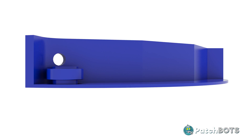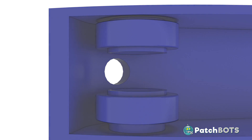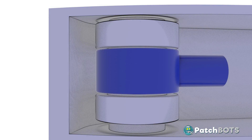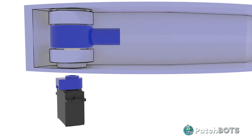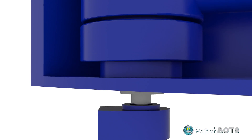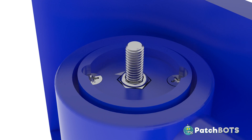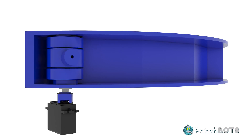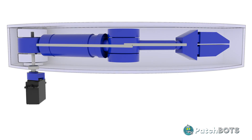The design for this is pretty simple. I'm going to start with a main box to house the arm with a lid. These pieces are going to have the top and bottom parts of the main shoulder swivel built right in. Sandwiched between those two parts is going to be our main rotating shoulder hub. This will have a bearing installed inside of it and will connect directly to an HS645MG servo below via an M5 bolt. This bolt hits a bearing at the bottom of the housing, travels through the main hub, and locks at the top with an M5 locking nut bound in a plastic piece screwed directly to the hub. This will give us the controllable rotation of the arm that we want, and the rest of the arm will be built off of this main hub and supported with M3 steel rods.